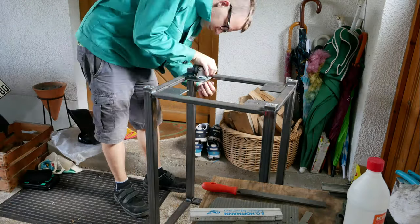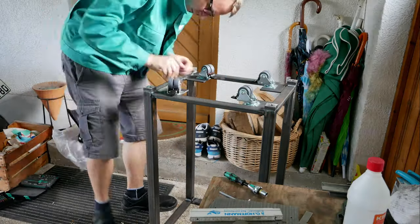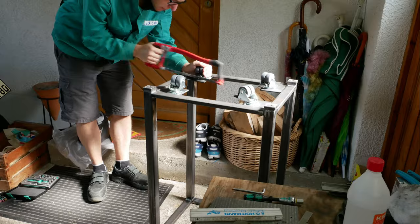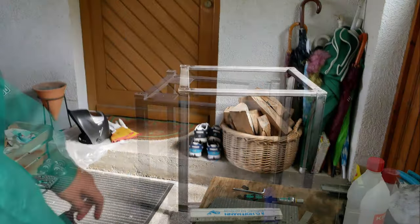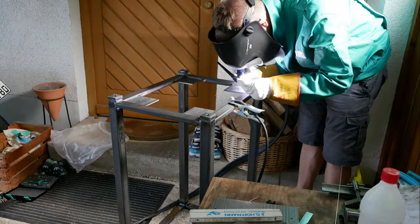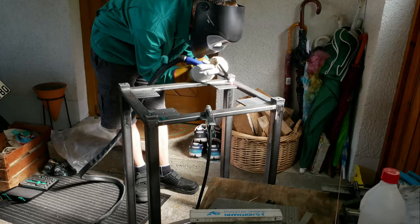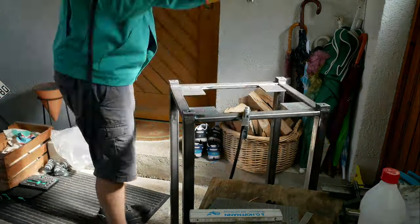Test fitting the wheels showed I had a little bit of interference with the brake lever. I ordered the wheels without a brake but they came with a brake, so I just shortened the brake lever so they can rotate freely. Then of course I welded those plates solid because they have to carry quite a bit of load when the drill press stand is on the wheels, so I wanted them to be very solid. I also added more corner pieces.